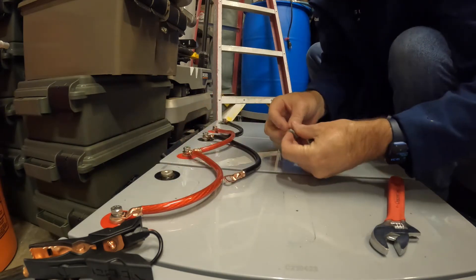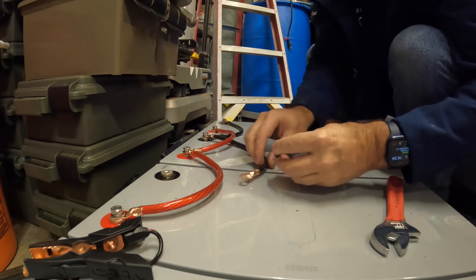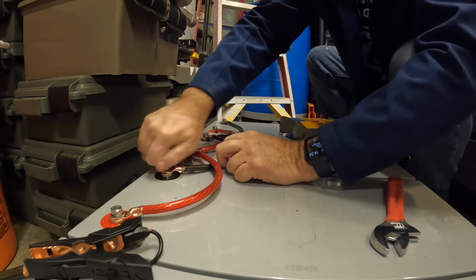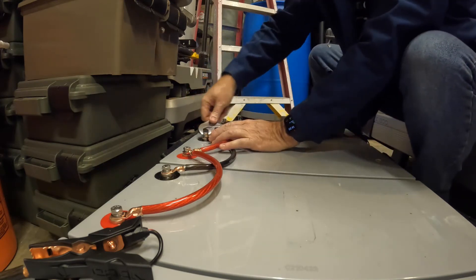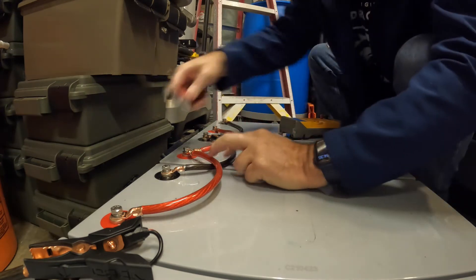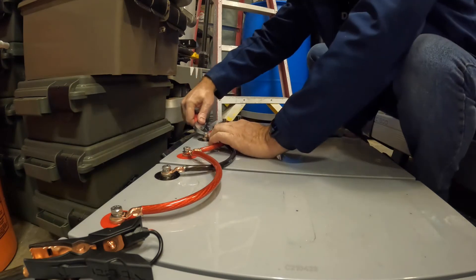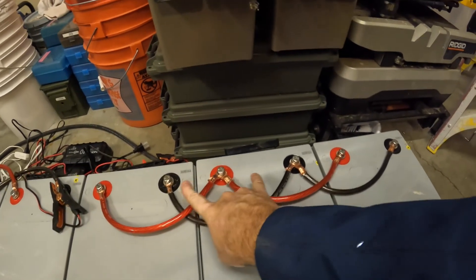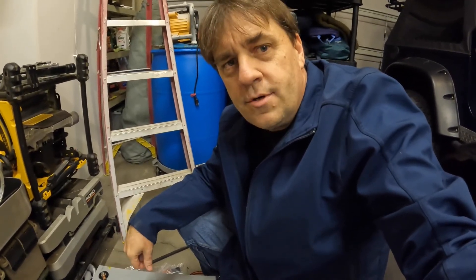Be really careful when doing this — you don't want loose cable ends flopping around and hitting a positive terminal, because you'll short the whole bank out and that would be really ugly. Go slow and watch all the ends as you connect them. Also, it's good to use tools with rubber-covered handles because if a tool falls across the posts it can short them out. There we go — those three are in parallel now, so let's get a charger hooked up.